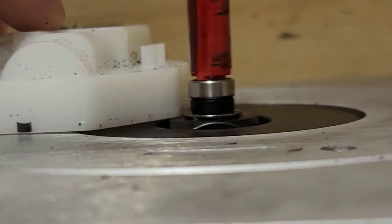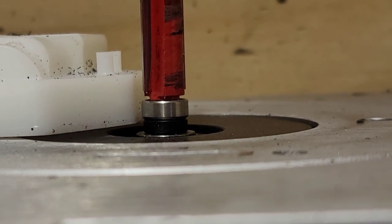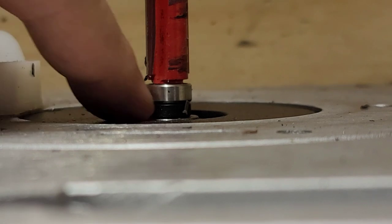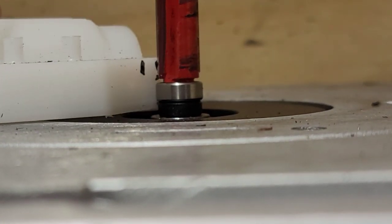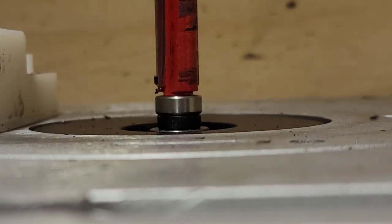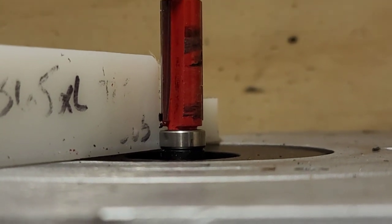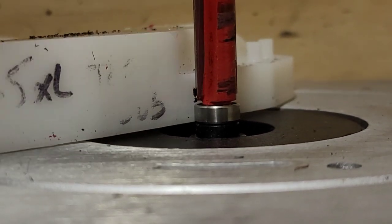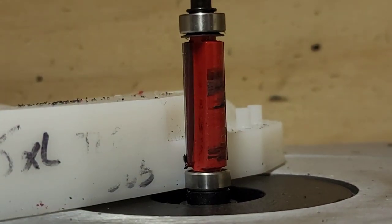This is not what you want to do — see how that is above the black? If I take this right here it's going to hit right there and then dig around here — you don't want that. So with this sitting here we're going to unlock it and lower that below. It's locked in place, so now this is going to run right there. Notice the locking plate or ring here is a smaller diameter than the bearing, which means no matter what you do, this will never hit that plate even though everything is spinning at the same speed — the outer bearing won't, because you're rolling against it.